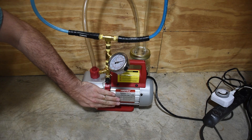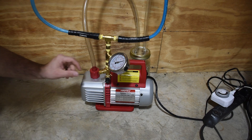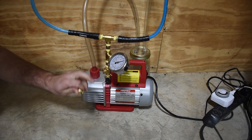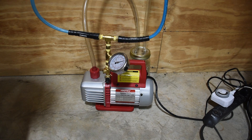Once you go from that pump, the next thing you're going to hear about is a vacuum regulator. Mine is pretty archaic — I'm essentially inducing a leak into the vacuum system to regulate the pressure. But all vacuum systems need a way to regulate that vacuum pressure. Too little pressure and you're not going to be getting milk out of the cow quickly, if at all. Too much pressure and you can cause damage to the cow's teat itself.